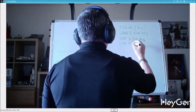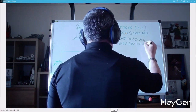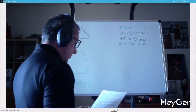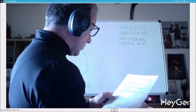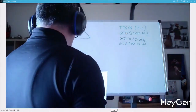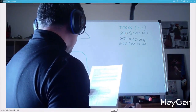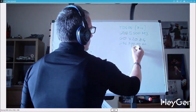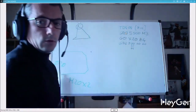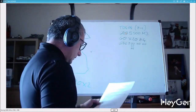The first pair of zeros indicates the number of finishing passes. So here we can write 0, 0, 1 or 0, 2. We can't write 10 finishing passes. The second pair of zeros indicates how the tool exits.